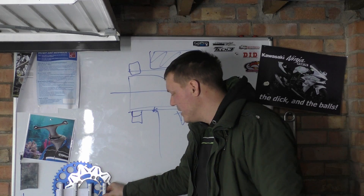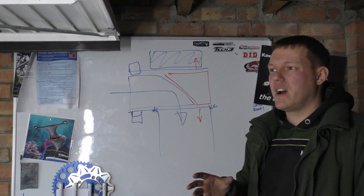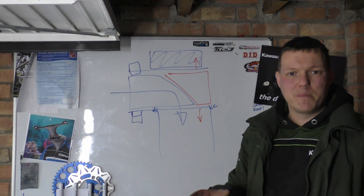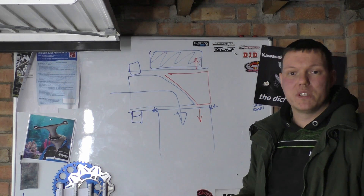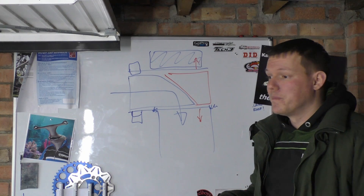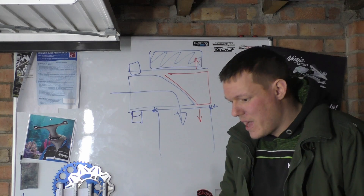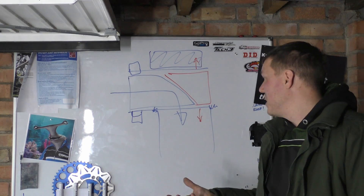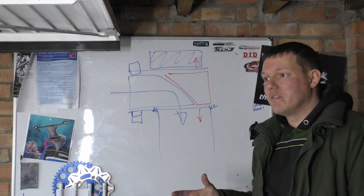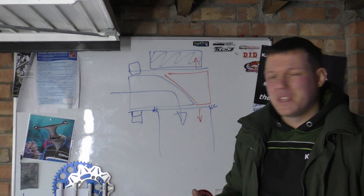That's the core problem. Timing would be a bit tricky too — you could only go so far, but you could have creeping ports and I'll actually do some CAD and look at some of the design aspects. On the positive side, if you're after high RPM it means you could have a port as big as you want — you're not really restricted in that sense. Spark plug location would be a bit of a headache though.